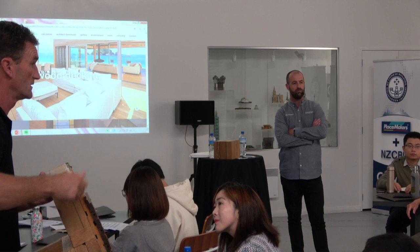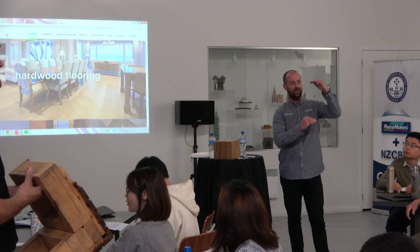Okay. Are there any questions? What's the maximum distance between two nails in vertical? For the nails, 400 to 480. 480 maximum. And horizontal is 600.